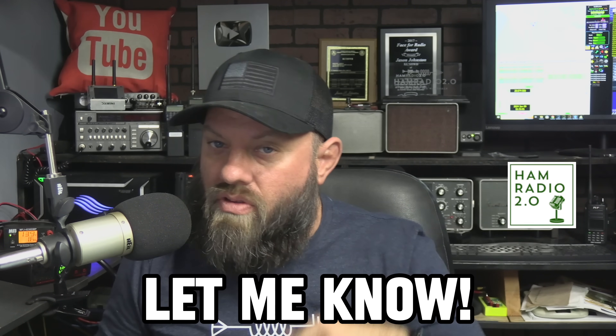What do I think about this radio? It's $80. One reviewer on Amazon said it's a much better radio than the UV5R, and I'm like, well, it's three times the price, so it should be. It seems cleaner than the UV5R at least on 440 - and a standard UV5R won't do 220 at all. This one's a little dirty on 146.52, but so is a UV5R and so are most Retevis and TYT radios. Put a comment below - let me know if you were the one who recommended this radio, and let me know if you have it and what you think. 73.